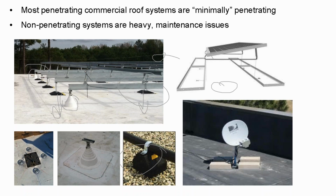So these are just little conduit supports that we're using to elevate our racking. And then at the edges, you see this pipe boot. And so we've gone and bolted into our iron rafters and then tamped down the TPO membrane. When I say we, I meant the roofing contractor that was in the area for this roofing system came out and did the pipe boot sealing. And this is actually on a TPO roof. You kind of use a heat gun and melt the flashing onto the TPO roof where it adheres, and it forms a very watertight seal.